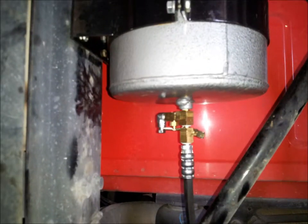Next, install the pressure hose assembly. Using the thread sealant compound provided, install the oil sample valve and the oil regulating valve assemblies onto the bottom of the inlet port of the oil refiner canister as shown.